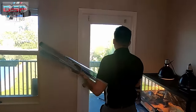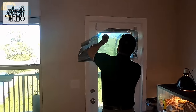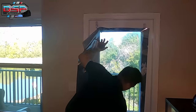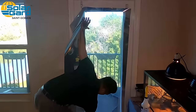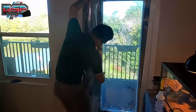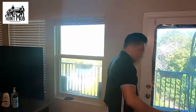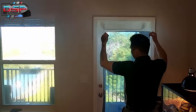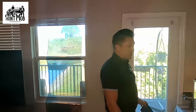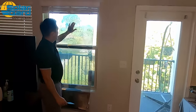Spray the window down and unroll the film liner-side out against the wet glass — the film will stick to the glass temporarily so you can pre-size it. Let it drop to the ground and cut right below, then trim off the big excess. You're shooting for roughly an inch past the edges. Move the film over to the adjacent glass as a makeshift peel board, liner side facing you. Place the film side against the glass, then use the putty knife to tack it down — squeeze out the water and hold the film in place.